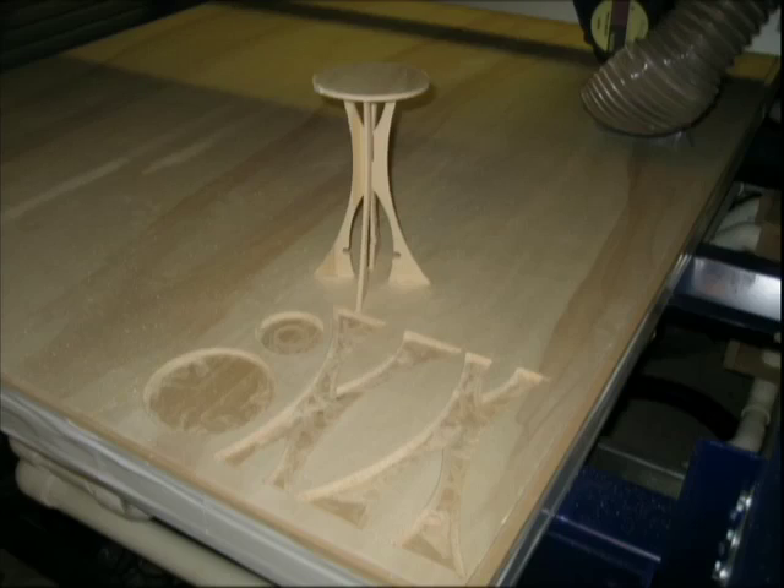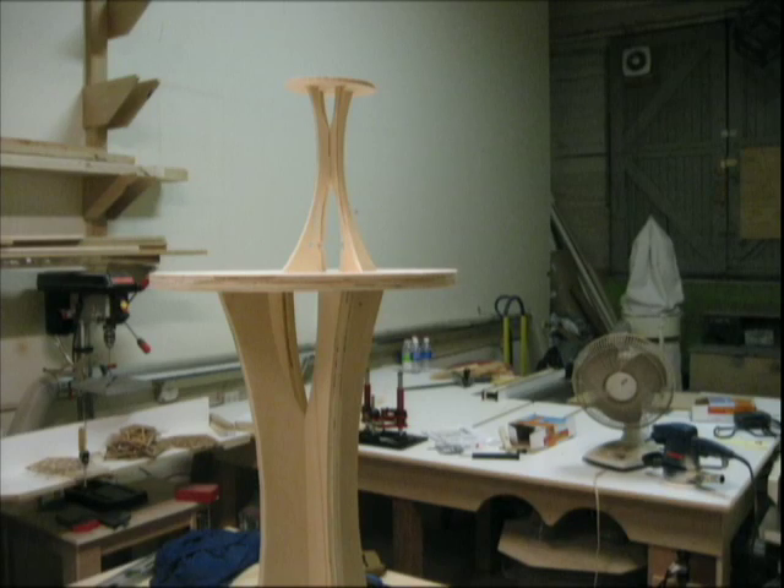If you design something for three-quarter inch material with a half-inch bit, you can scale the whole thing down proportionally to use quarter-inch material, find the right bit, and run the exact same tool path to build a scale model without changing anything. There's a little SketchUp layout here used to produce the tool path — there's the mama and the baby.